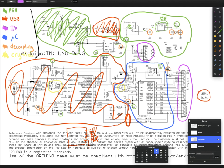So what they've done is they've got AD5 and AD4, and down here, AD5 and AD4. So those two are actually connected by their nets. So on the PCB, they'll be connected. But to make the schematic readable, they've just put the net labels there.